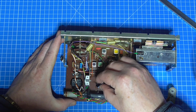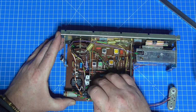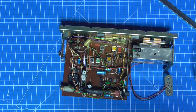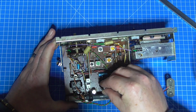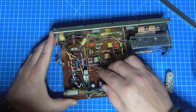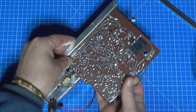So I need to put the 680 microfarad capacitor in there and bend the legs over on the other side so it doesn't run away while I'm putting the other one in, which is C42, I believe, yes, and is a 470 microfarad, which goes in thus. Bend those legs over.